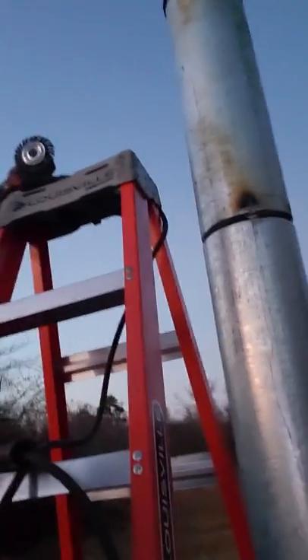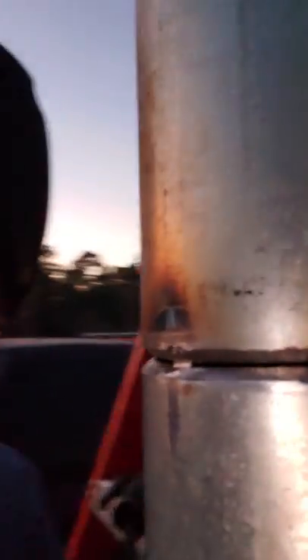For guys out there who maybe don't weld every day for a living, or don't get a chance to weld on pipe very often — when you do get a chance on something simple like this, fit it up properly. In all honesty, all I had to do was slap this together with a butt weld and put a heavy 6010 whip-and-pause bead on it and grind it down, and it would have held just fine. But my advice, since I have plenty of time under my minimum charge — fit this up like a piece of gas pipe. Yes, it's galvanized and will weld a little different, but fit it up properly because you'll need the practice. All this is is a 2G open groove weld, like we did in school every day.